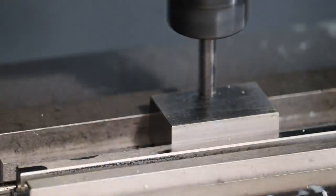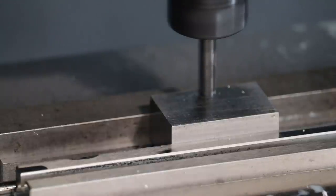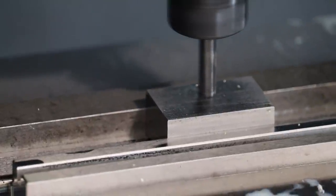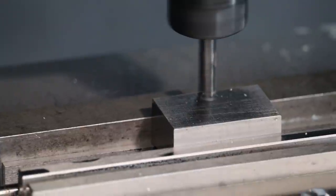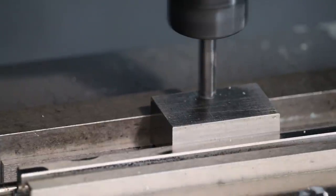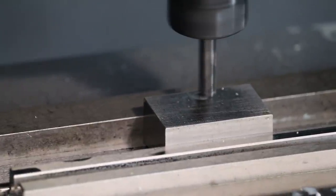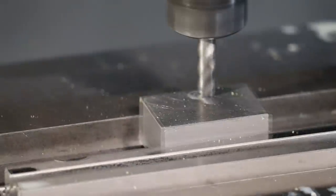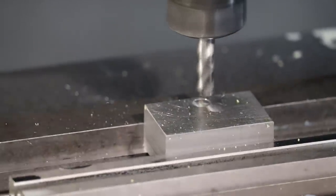We're going to back off 20 microns, or a little about 8 tenths. I'm going to move around and yeah, we're still cutting. So I'll come up another 10 microns. Okay, so now we're not cutting. And again, this is a safe area of the mold insert. So I'm going to start dropping the tool down by one micron at a time. I think that's good.